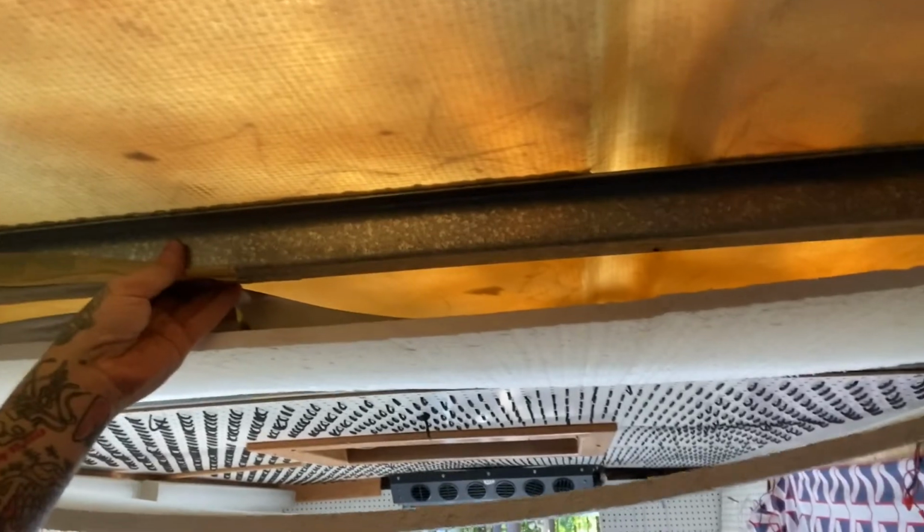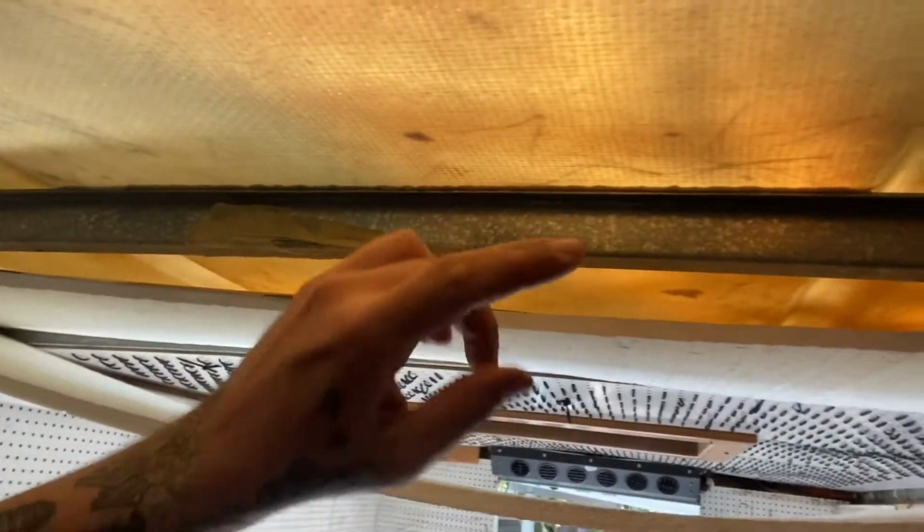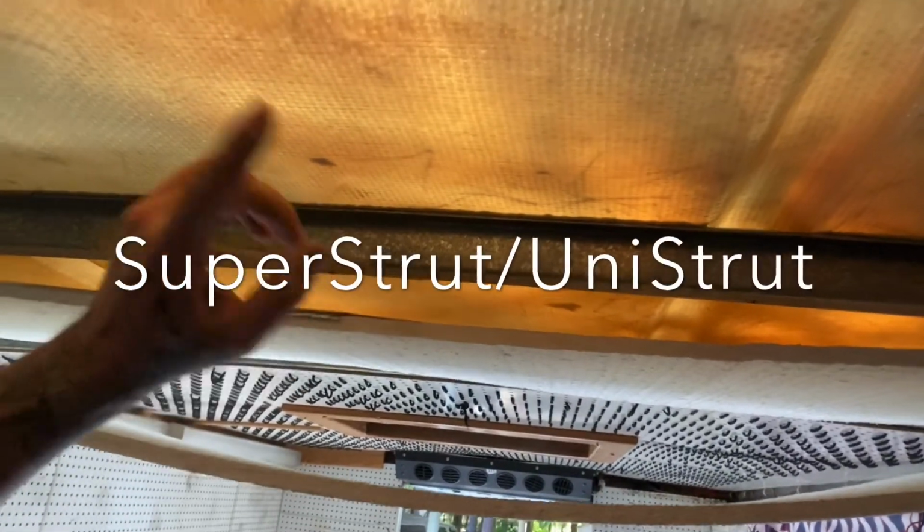That is galvanized steel, and that was one of my concerns about screwing into this stuff, because steel against aluminum makes oxidation, so now I feel better about possibly putting some, I don't remember what it's called right now, some sort of track up there so I can put some solar panels and screw into, somehow get something going on through there.